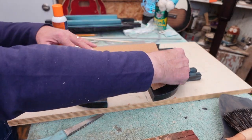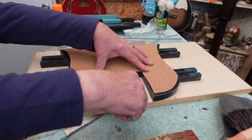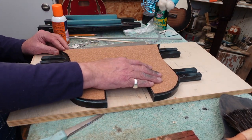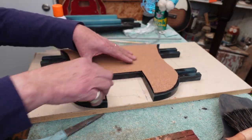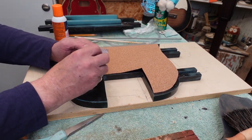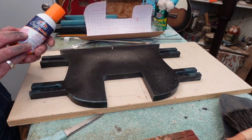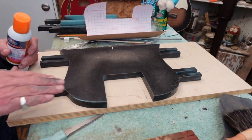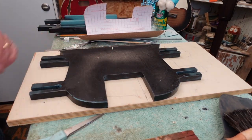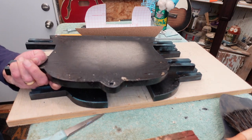There we go. This is the top part of the jig that sits up against the soundboard of the guitar, with the fretboard right here. You can see I'm back from the edge a little bit. You may want to trim this corner back just a tad more. The cork paper has adhesive on it already, but I'm going to take this outside and give it a quick coat of craft bond used for scrapbooking — that'll make it extra sticky so we won't have to worry about it. I'll do that with this one and the bottom section.